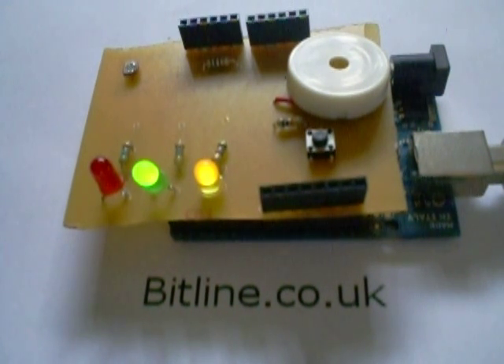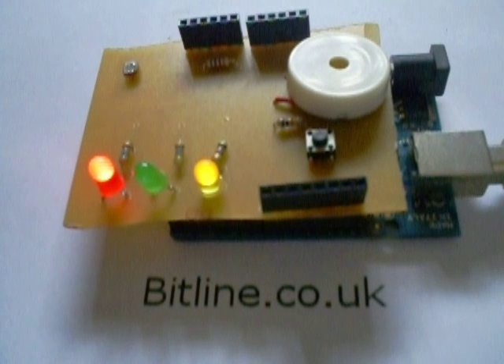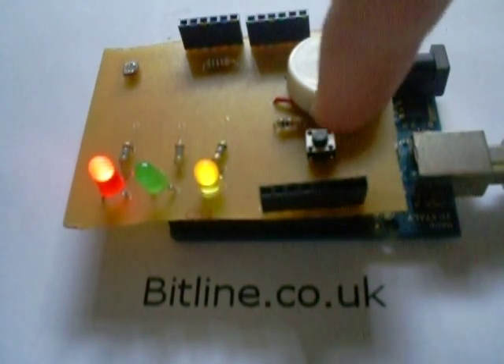The green LED shows the buzzer's going off, and the yellow LED there to the right informs you that the buzzer has been off, in case you missed the buzzer. After about 10 seconds, the buzzer goes off. You can now see the red LED is on to say that it's ready to count whether the laser beam is being broken, and the yellow LED remains on to tell you that the beam has been previously broken. To reset this, you simply press this button here.